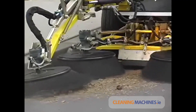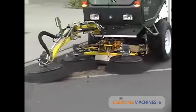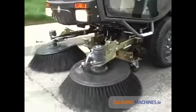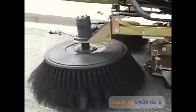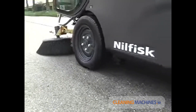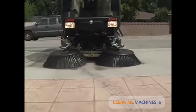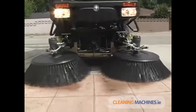The RS machines avoid messy and high-maintenance dust filters and bags, and instead use the most common form of dust control systems in outdoor sweepers: Water Dust Suppression. A dust curtain of water is applied to the front side brooms and pavement to initially knock down the dust. Inside the vacuum head, a second set of spray nozzles further suppresses the dust to get it to settle in the hopper.